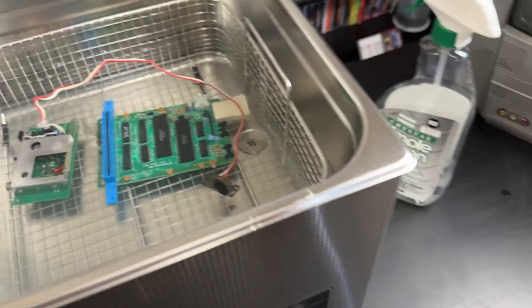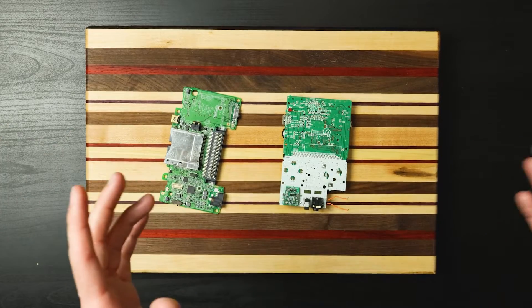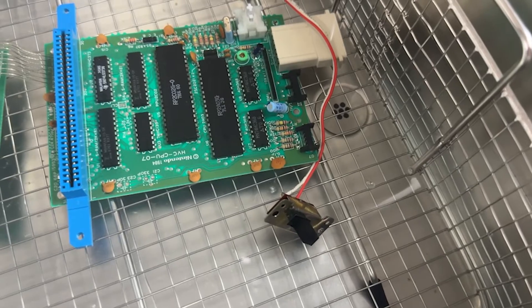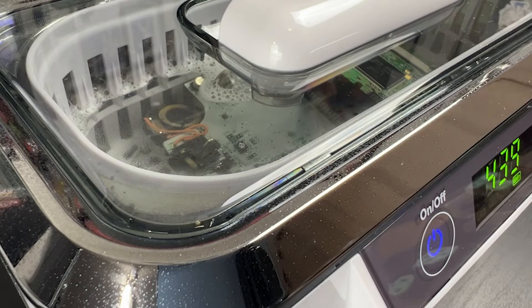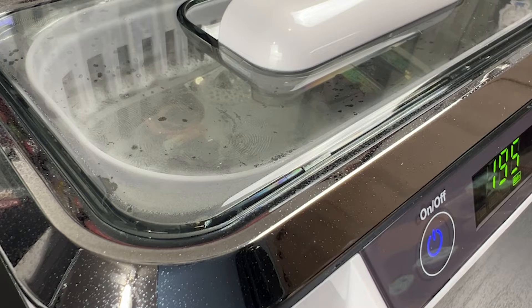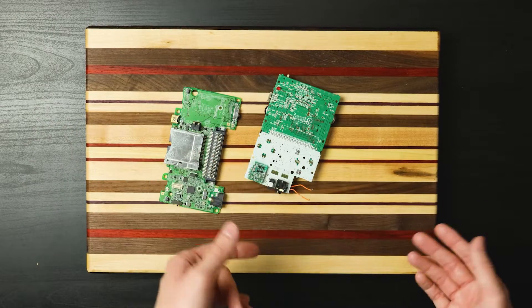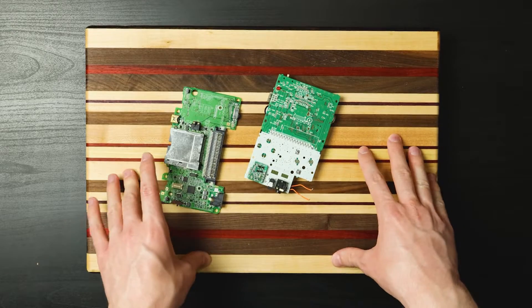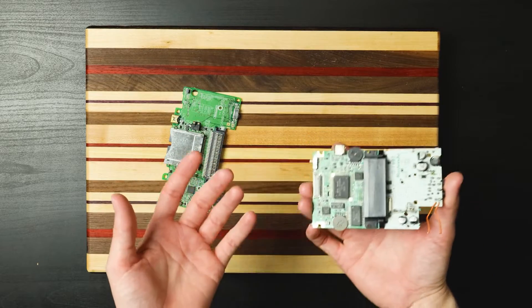That's actually how you clean these things. Even 99% isopropyl alcohol is 1% water — it just dries fast. But isopropyl alcohol is extremely flammable and you should not be using that in an ultrasonic cleaner. For that I used some industrial Simple Green Crystal, but that was giving me headaches, so I'm going to try regular Simple Green next time. I heavily watered it down — like one part cleaner to 30 parts water. I started with my mom's cleaner, then got a bigger one, then ended up with a giant 15-liter unit — the best $160 I've ever spent. Don't include speakers when you do the cleaning, because it will ruin them. I'll link the big one and a smaller one down below, but honestly unless you fix a lot of electronics, I don't think it's necessary.